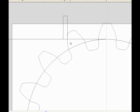up the length of the tooth, and we find that tangent point for each position on the tooth, and we shave it with the edge of the tool, we will have created an involute flank. We then repeat the process with the other side, and that is essentially the process of involute shaving.